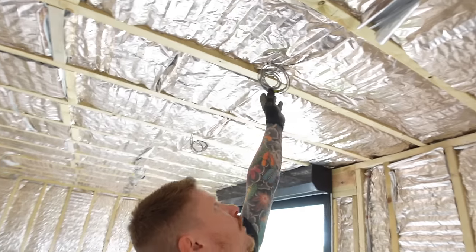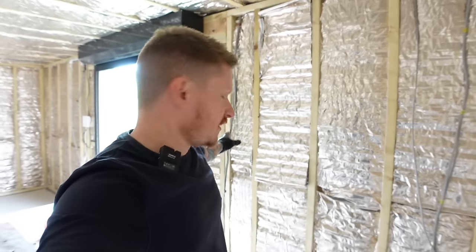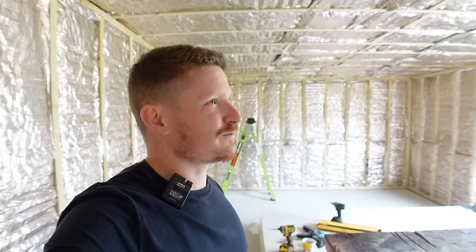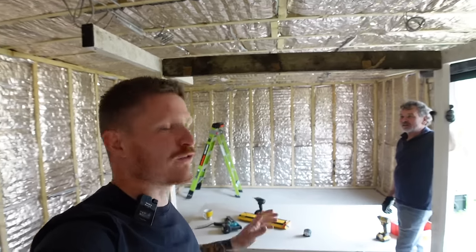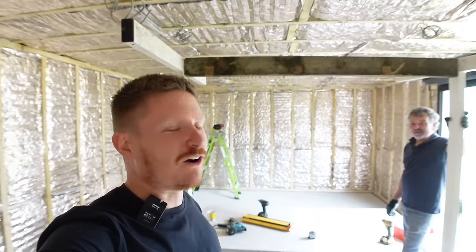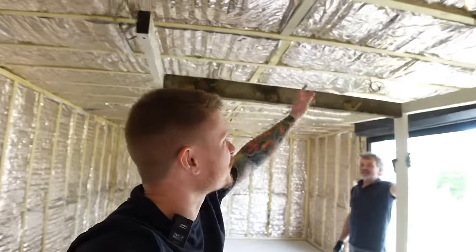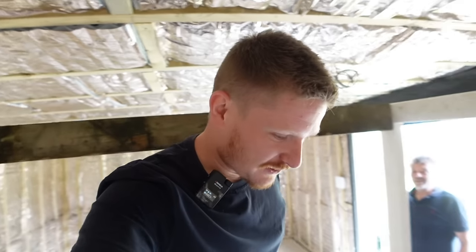Before you go plasterboarding anything, make sure you write a plan of where your cables are, because once this is plastered you need to know where the holes need to go to pull the cables through — and the same for sockets and switches. We also need our makeshift plasterboard lifter. This is our homemade version — it lifts up and down, you pump it up, put a bit of plasterboard on top, and you can even stand on it to screw as you go. It's nothing fancy but it works brilliantly. First sheet's up. We've got a laser line running down this joist so we're squaring the edge up with it, staggering the joints from there.